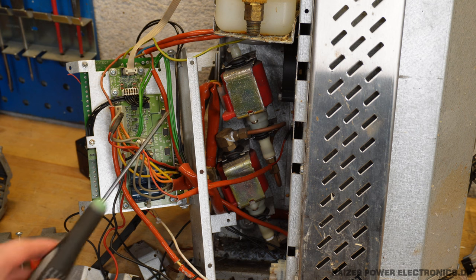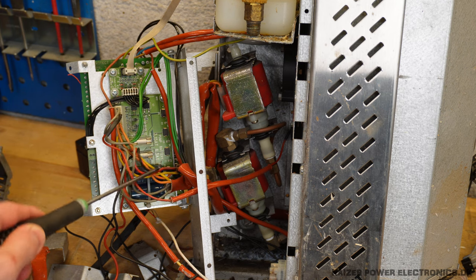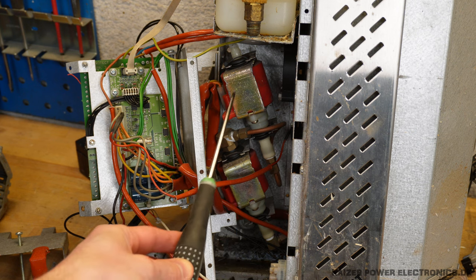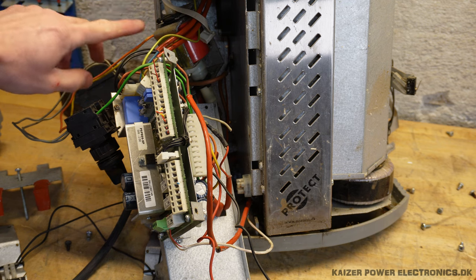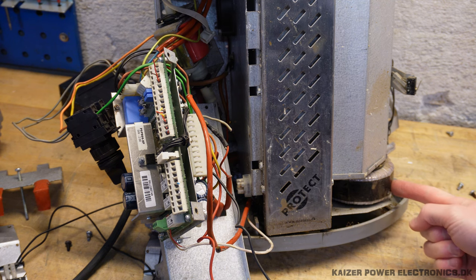With the controls taken apart a bit more, there are another two PCBs at the back of the control card. We have the level sensor going down to a small board here, which connects to the main board. Then we have a pump driver board, which goes to these two pumps sitting at the back. These pumps are put in series, so maybe that's just for getting higher pressure — one pump was not enough to push fluid fast enough into the large heating element over here, or the 'cooker,' whatever we should call it. There's a small fan in here, so that's what we could hear spinning. We could try to give these their voltages to turn on and see what happens — 24 volt AC — and that worked. Down here we have a 24 volt AC transformer that actually feeds the pumps.